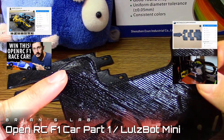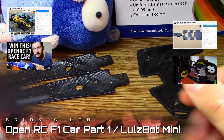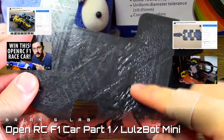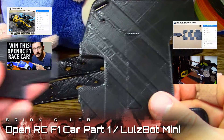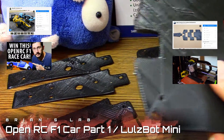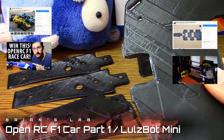It curled up and caught the extruder so it couldn't finish. Eventually I did have some luck and I printed out the base — still pretty darn ugly — with this Hatchbox black PLA. I just couldn't make them fit even after I changed the initial layer thickness, the flow rate, and adjusted all sorts of settings.